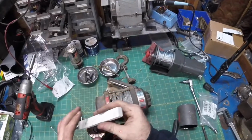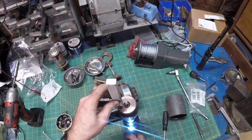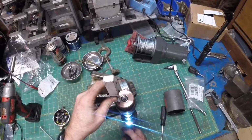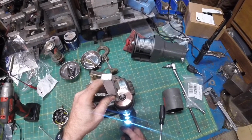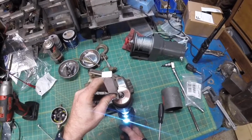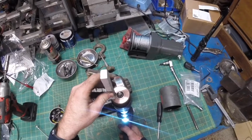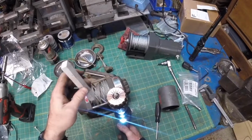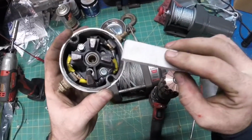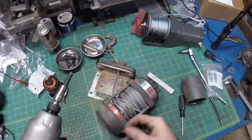If you have any old tools with brushed motors that aren't chooching like they used to, invest in one of these commutator cleaner stones. This exact $13 stone has saved me literally thousands of dollars on industrial electric motors, drills, starter motors, even my trusty Dremel. You might think emery cloth could do the same job, but that crap leaves conductive dust behind, which inside a motor is no bueno. It also helps bed in brushes. Had to break out the standard bits for this old American girl.